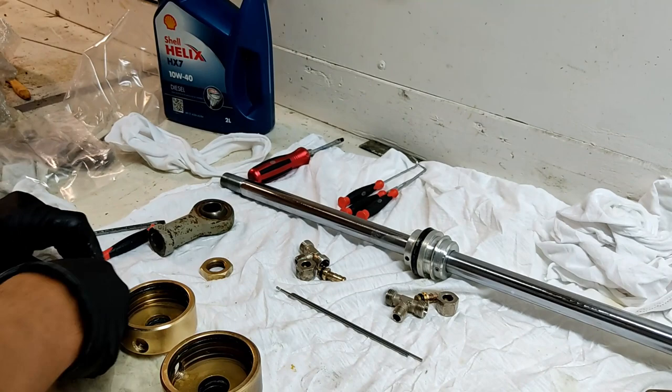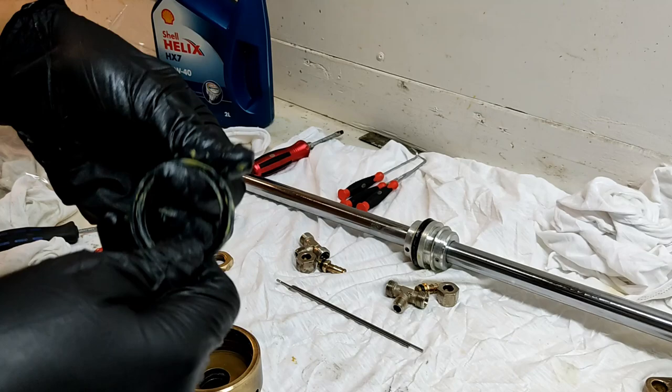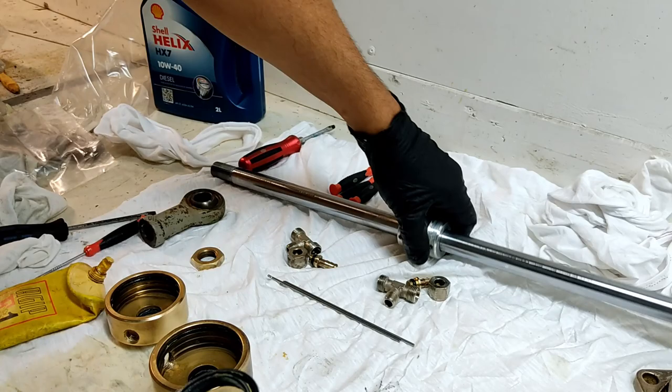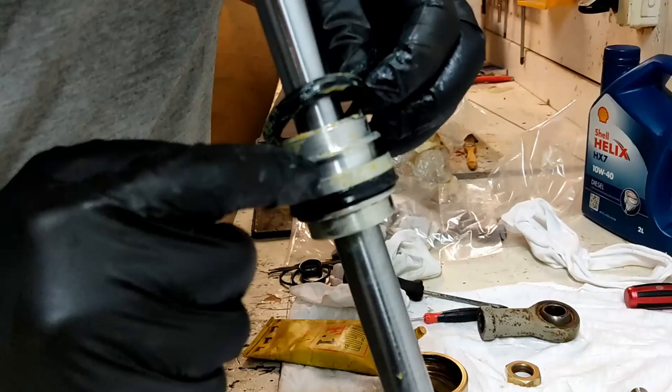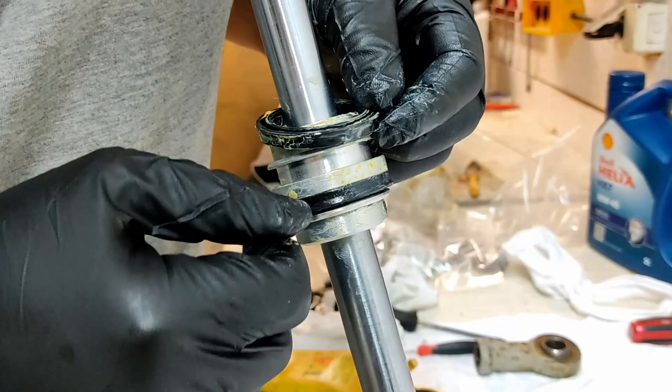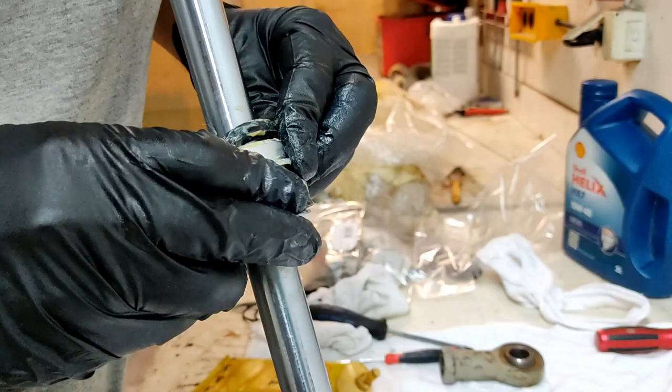Now, if I wasn't using this lubrication, particularly with putting that one on, there's lots of sharp edges that this lip seal had to slide over. Without any lubrication on there, you can actually cut the seals quite easily. If you cut a seal, basically it's a bin job. So you can see there's lots of sharp machined edges here. Without the grease, it'll hang up on them and potentially cut them as it slides over. So having lubrication on there to get them on is quite important.